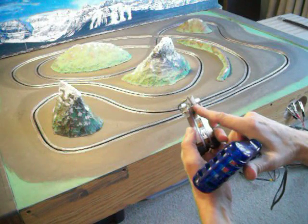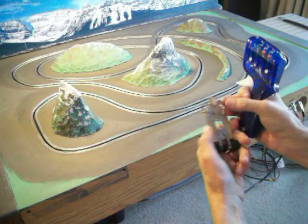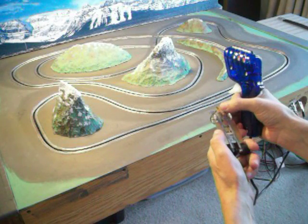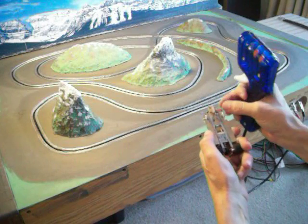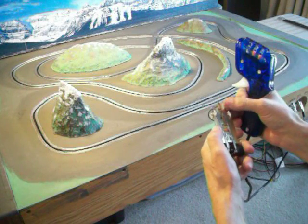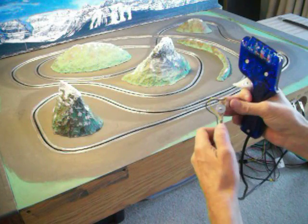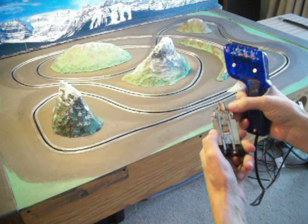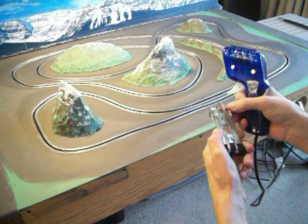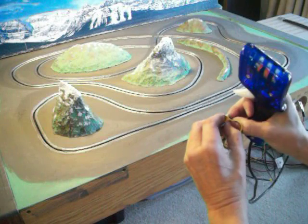The guide here is a guide slide, and I had to modify it somewhat because the brushes — usually the wire just runs through and it becomes a brush after you strip the insulation off, but it wouldn't make contact very well with the braid. So I sliced open the little holes that are there, put some braid in, and just soldered it together, and it seems to work pretty good.